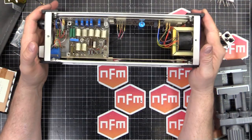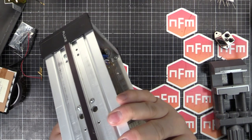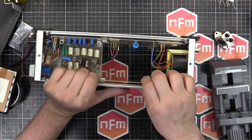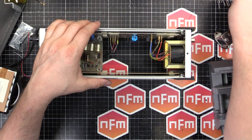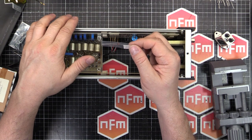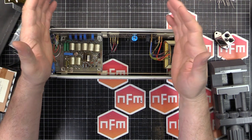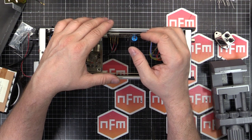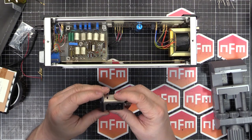I've heard that they can sometimes drift around a little bit, maybe sometimes. So I got two equivalents. What I've got in here is actually labelled CR505, 1 milliamp. I think these are rated at 50 volts, current diode. The ones I've got, the E-102, are the same 1 milliamp, but they're 100 volt because technology makes things better over time, and they can go in if needed. A lot of this stuff I just bought just in case because it's so cheap to buy a couple of resistors, and I don't want to get stuck and have to go to Akihabara again. Well, I do want to go to Akihabara again. I love going to Akihabara, but I want to get this thing done now, so I don't want to wait another day or two to make another trip.